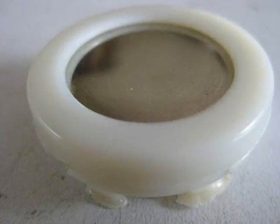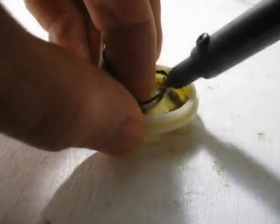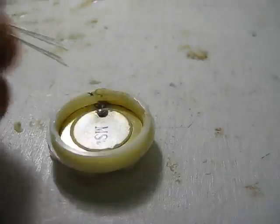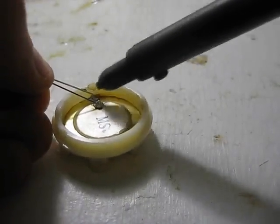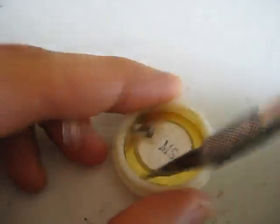To start with, I needed a piezoelectric crystal. I found one in a gift card speaker. I then took it apart, soldered an LED to the piezoelectric crystal, and then extracted the crystal from the case.